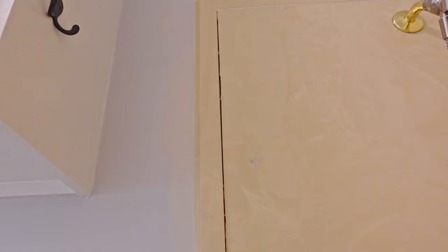I also need to fill the holes left by the shower door mounts since I'm going to use a shower curtain rod instead. I've removed the caulk on this side of the shower wall all the way to the top. One side wasn't as bad and I probably could have left it, but the bottom part is pretty bad, so I'm pulling that out too. The inside edges of the back wall are pretty good so I'll leave those alone.